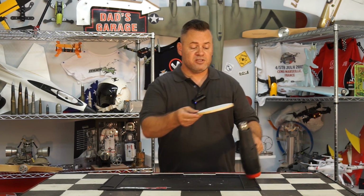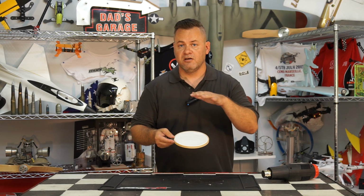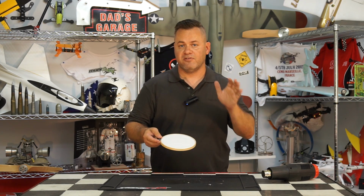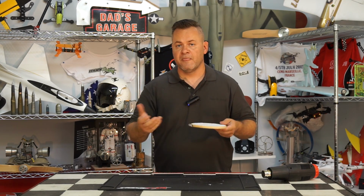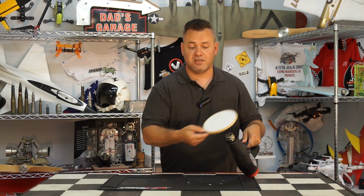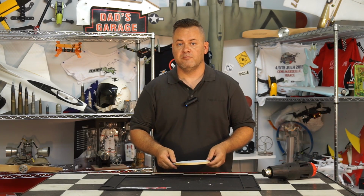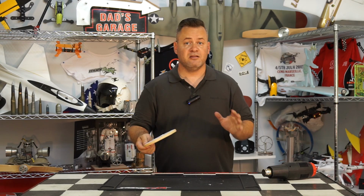Now, when you're moving this over, it's critical that the plastic is evenly heated. If it's hotter on one side than the other, it's going to draw in on that side, and you're going to have a thick vacuum form and a thin vacuum form. Since this is so small, it's not really going to be critical on this, but just try to keep it moving and keep the heat absolutely even, and then we're going to rotate straight over and put it right down onto our vacuum. So the whole process from heating to vacuuming will probably take less than 20 seconds or so.